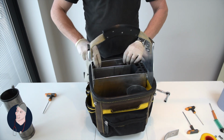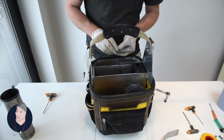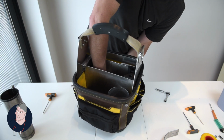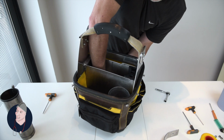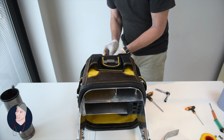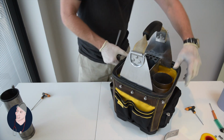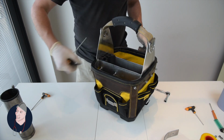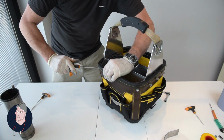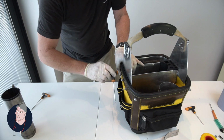Now the first thing I'm going to do is, through the bottom there's a captive nut. Oops. This is what I wanted to do. This is probably the most tricky part of this, because I've got such big hands. Stay in the bottom like that, and then I'll just tighten it. The next thing we do is tighten these bolts, so each one of these has got threaded bits straight into the side, into that gusset. Just want to make sure I capture a couple of these before I start. That's got that one.